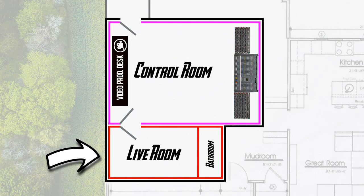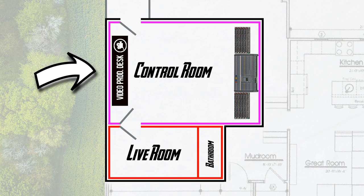I have two spaces to heat and cool: the live room / vocal booth and the control room. The control room is much bigger, so I'm going to use 8-inch ductwork there and 6-inch ductwork in the live room. Each room needs one duct pulling air back into the system and another pushing conditioned air out — so the control room needs two baffle boxes and the live room needs two, giving me four total. Two will be for the 8-inch ductwork and two for the 6-inch.